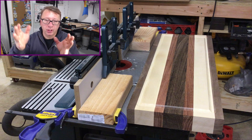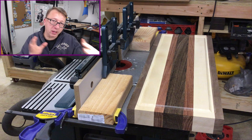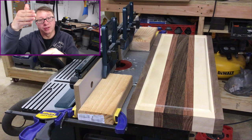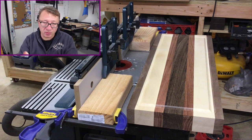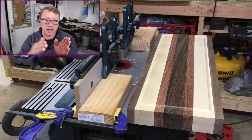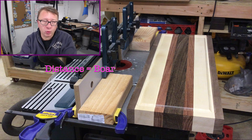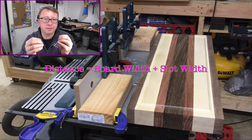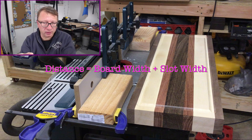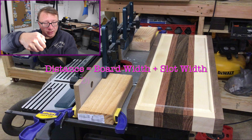So let's cut over to the video montage. This picture here you see on the screen is very straightforward: you have the router table, the cutting boards off to the side, and two two-by-fours held to the router fence on either side of the bit, which is in the center. To make a handle in this cutting board I did a full-depth cut with the one-inch router bit. I separated the boards by the distance which is the width of the cutting board plus the width of the handle you want to make. In this case the cutting board is about 11 inches and I wanted to make a three-inch handle to stick your hands in.